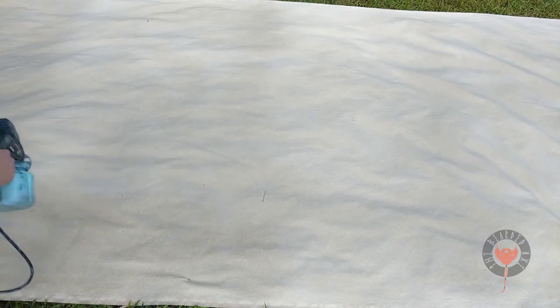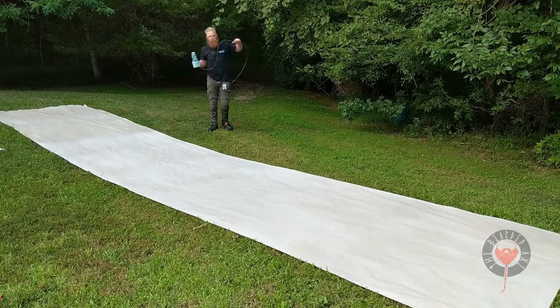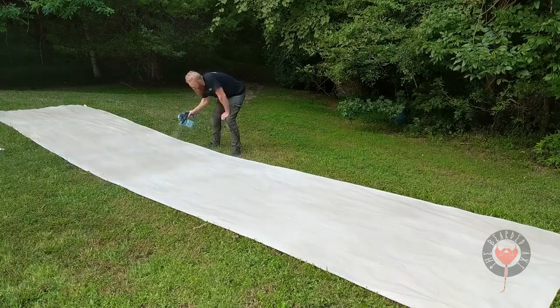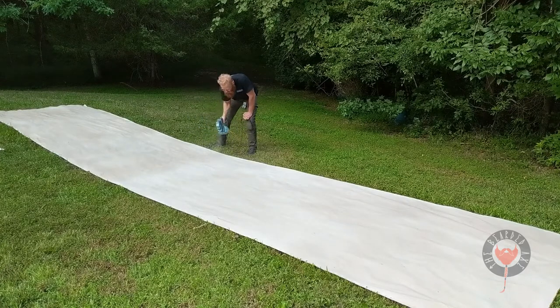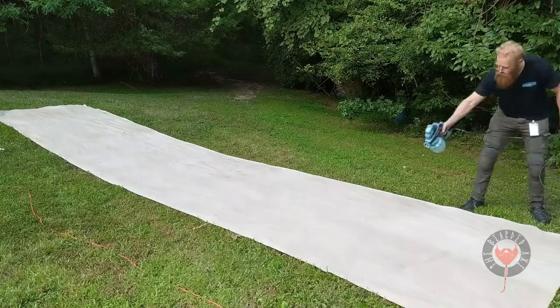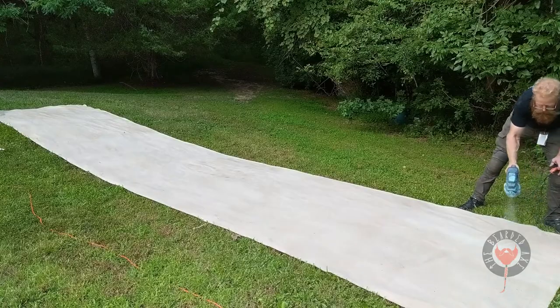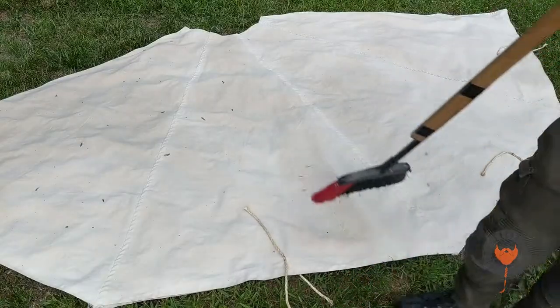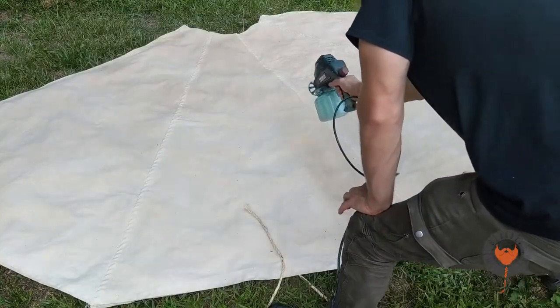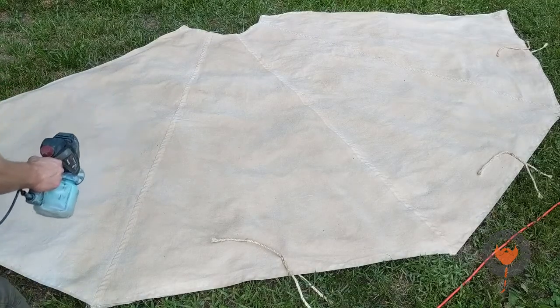What I have here is just a power sprayer that I got from a discount tool store. I'm sealing it up with Thompson's Water Seal. Originally I swore by it, but after a year this stuff still remained oily, so it's not ideal. I had to go through about three to four gallons of Thompson's Water Seal in order to seal up all the canvas — and it's not a lot of canvas. I have since resealed it with boiled linseed oil and mineral spirits: a 50-50 mixture that solidifies after about three days. It's perfect, and we'll see how long it lasts. It should be much cheaper than Thompson's Water Seal and much more effective.